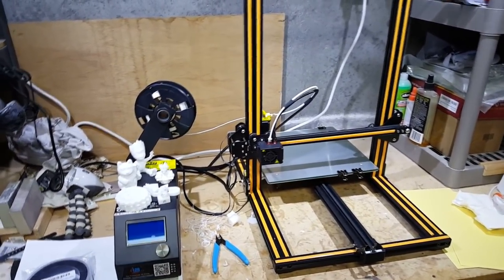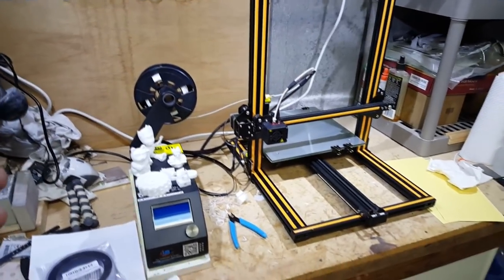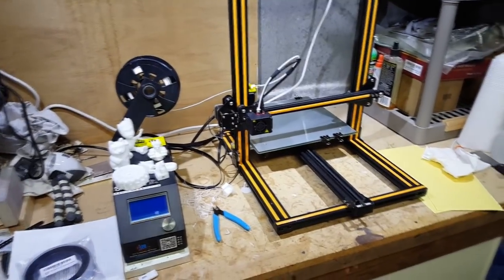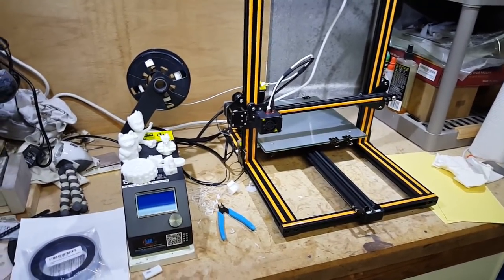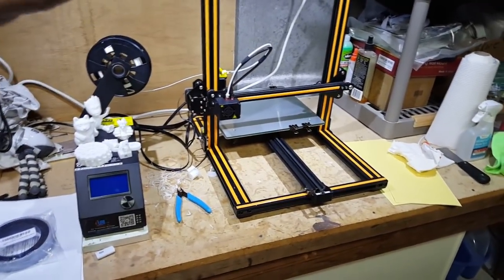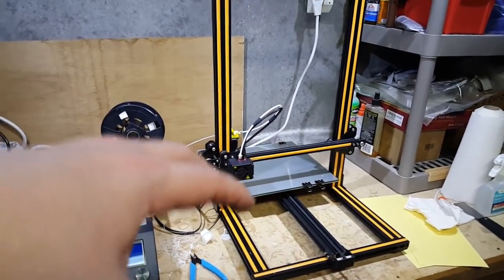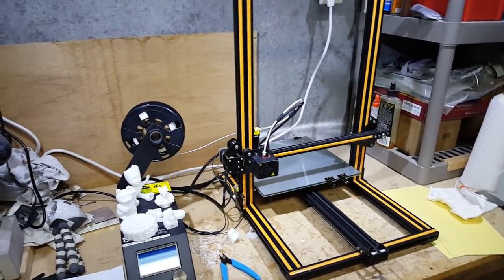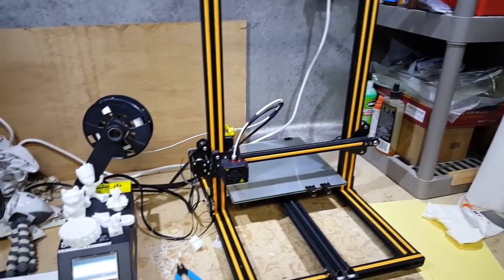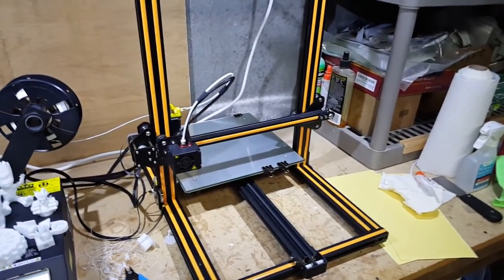I was surprised at how quickly I had this machine set up, and at the lack of time I spent getting a successful print. If you're using the latest version of Cura — C-U-R-A — it's a 3D printing slicing software. You download your STL files from Thingiverse, open them in Cura, and when you install it, it asks what printer you have. The most recent version had the CR10 in it, so you don't have to pick a different printer and make a bunch of adjustments. The bed typically prints at 60 degrees, the nozzle at 200, and the filament layer height is usually set at 0.2 millimeters. There are all sorts of settings in there and I really haven't fussed with them much.